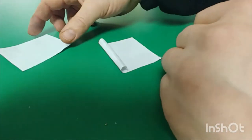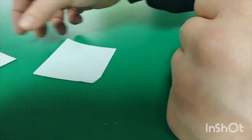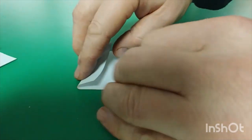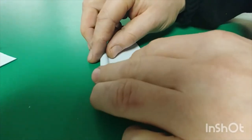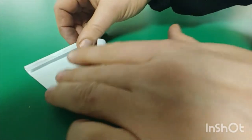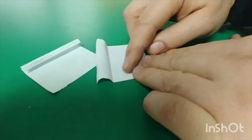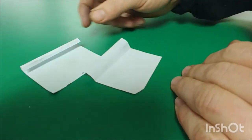Unfortunately for us, Mr. Terry English, in his ever-knowing wisdom of ways to make armor look cooler, what he actually does is he rolls it back at a 45 degree angle up. Well, I don't know that he does that step first, but I do know that he then rolls the armor in against the skin. So instead of having your crease on the inside exposed, you have a nice seamed edge that is, it's just a better looking edge. It looks better than this.